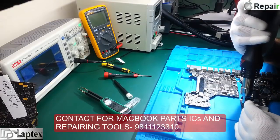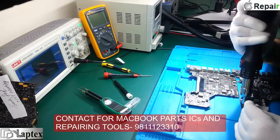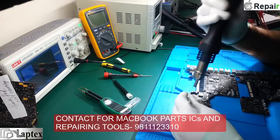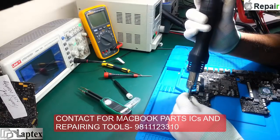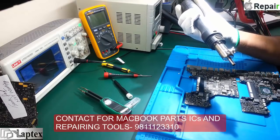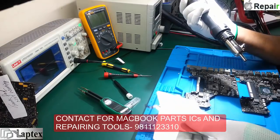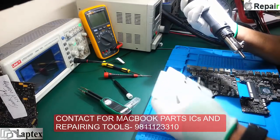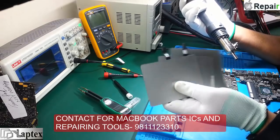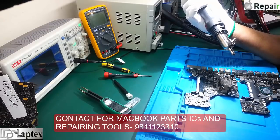You need to see that if you get 18V on the Schottky diode, your board will be okay. For that you need only a touchpad connected to test whether it is working or hanging. I have several touchpads here for testing purposes — some have the hanging problem but I use them only for testing when the touchpad is not working.